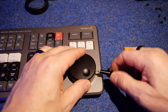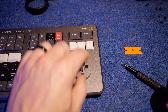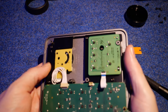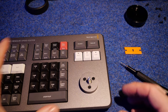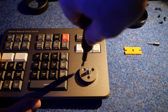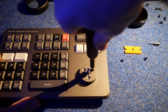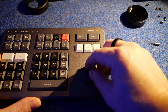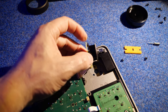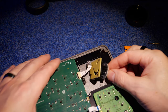There is the shaft that rotates the optical encoder on the inside - is there a mechanical connection? Yes, I'd say there would be. I would have to remove these three Phillips head screws and then that whole assembly will come out with the carrier board. Those appear to be M3 machine screws, countersunk. There we go - that assembly has just come away, just like so. It's actually a self-contained unit.